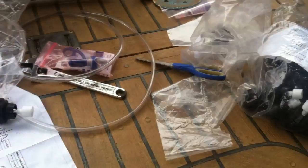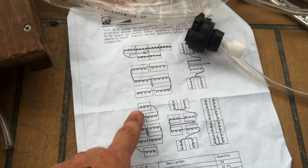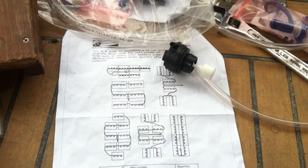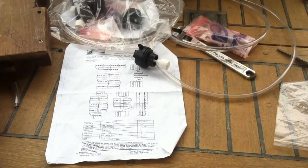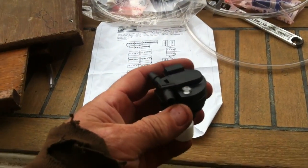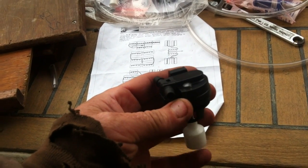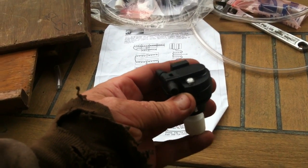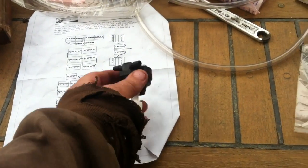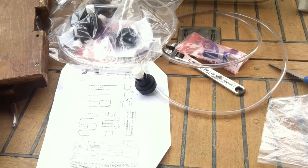That is what I'm doing today. I wanted to show you this battery watering system — you can see here are all the diagrams for how you can connect them. These little watering gadgets are not that cheap but they are worth every penny because they will keep your batteries always full after you gas out, and you will never have a dry cell — and that is the key.